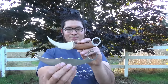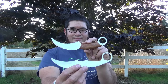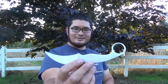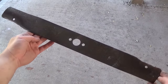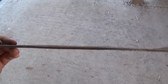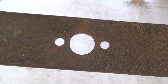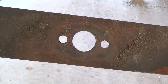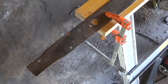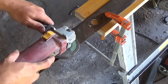Just like this one, it makes use of a lawnmower blade with a one-inch center hole so that you don't have to do any additional work to make the safety hole. The lawnmower blade I'm using is two and a half inches wide, about an eighth of an inch thick, and it has a one-inch diameter center hole. If you can find one with a one-inch or similar diameter center hole, you don't have to do any drilling or grinding to make the safety hole for this knife.